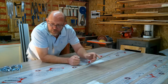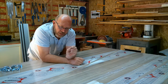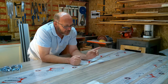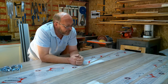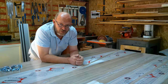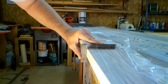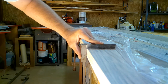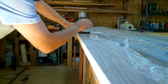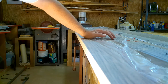My problem is whoever cut the one piece — their blade wasn't square or true. What's happening now is it's making a gap all the way of about one and a half millimeters, and that looks horrible. So I'm going to try with a track saw to get the one edge square so that I can get the joint nice and perfect and closed. I hope I don't ruin this top. Let me show you what I mean by out of square — it's not much, but that little gap shows all the way when I try to join the two pieces. So this guy's blade was a bit off, and that creates a little bit of a problem. We're going to try and fix that with a TS-55.